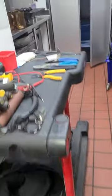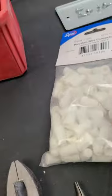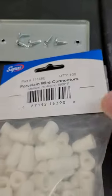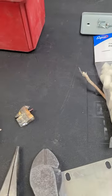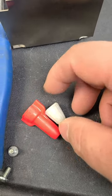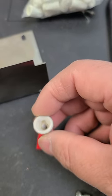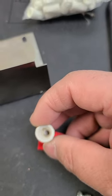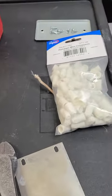After that, we've got this ceramic wire connector. One thing I don't like is that these don't have size numbers or anything like that. We put one of them against a regular wire nut, and because it doesn't have the extra wings, internally they seem to be about the same diameter. I'm pretty sure this is going to work for the number 12 wire that we're using — we're only connecting two wires anyway. But yeah, it was a bad choice.